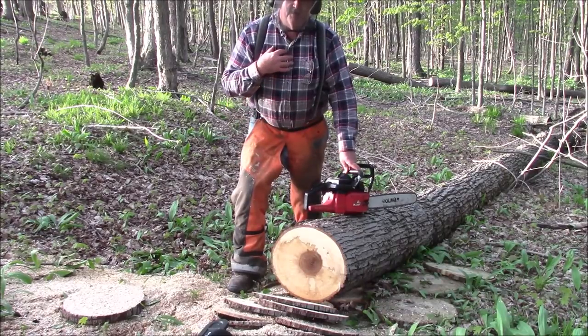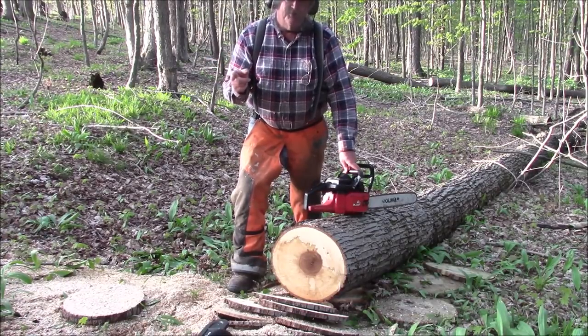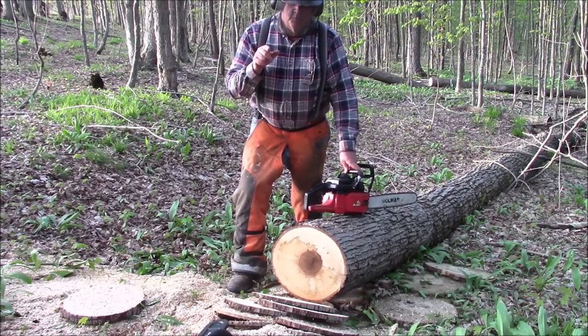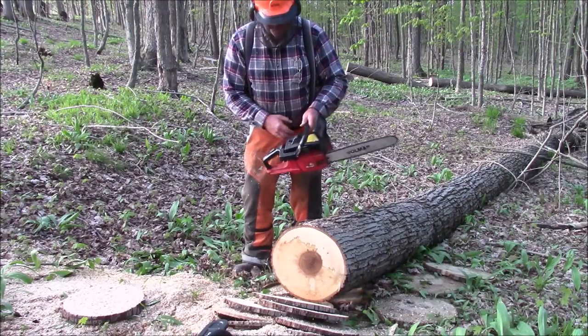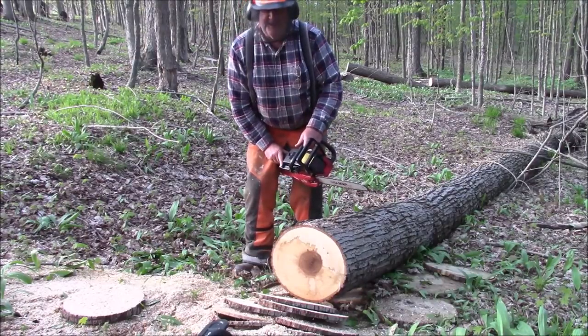So in my mind, even though the times might be close, the feel of the Husqvarna said it had more power. Not much, but more. But what it had was more torque, where I could lay on that saw and jam that dull chain through the wood and still get some decent chips. And I'm telling you, take out that cat muffler, do a muffler mod and a base gasket delete, and that Makita is sitting there right with it. So the times here don't really matter. So how about this one? This one here probably is not in the same power class as either one of those two. But it's a nice little saw.